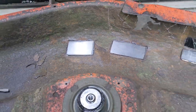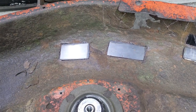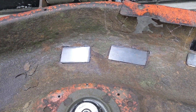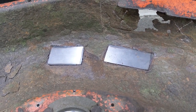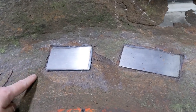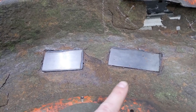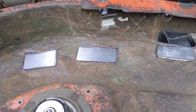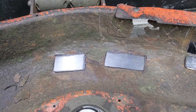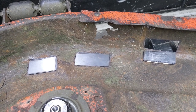There were some comments in the first part saying why wouldn't you just cut out a larger section and weld in a larger section? The answer is the more you cut away, the less original metal of the mower deck you're going to have to weld to. There's no end in sight for where this chipping stops. For today's video, we're cutting out some of these pieces - I've already started. I'm going to get these tacked into position and I'm using the plasma cutter to cut those pieces out of the plate I showed you in part one.